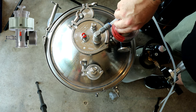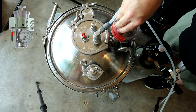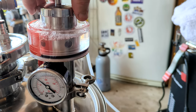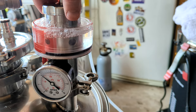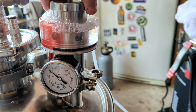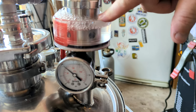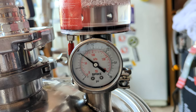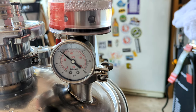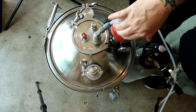It's not coming out of there, but if we loosen it off, it puts some pressure out. There you go — the bubbles start coming through. We've got a small bubble coming through, and we're set just over 10 psi. About 10. That'll do me for this.